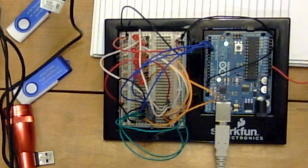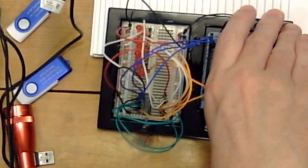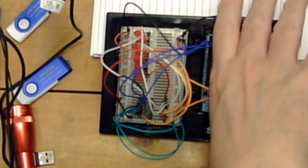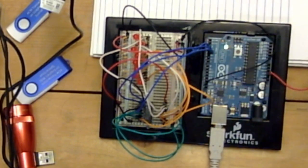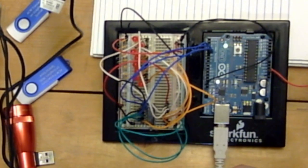The Arduino simplifies that by saying the main function always calls setup and then calls loop in an infinite while loop. There's also the question of what happens after you remove and reapply power—does the board retain the uploaded code? We can test that quickly since it's powered by USB: unplug it, plug it back in, and it's still running the previous program. In Arduino, programs are called sketches.